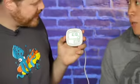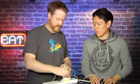I'm going to unplug the iPad. It's going to go down. Yep, and it is below half a watt. So this is the other thing that this is really good for. If you have a lot of wall warts and you're worried that these things that hang out of the wall are siphoning power off when there's nothing plugged into them or when the devices are already charged, this is a really great tool to keep track of that and figure out which are the bad devices and which are the good devices in your house.